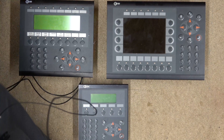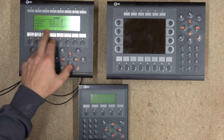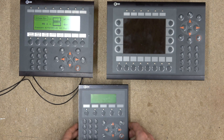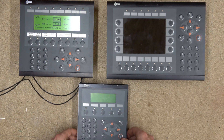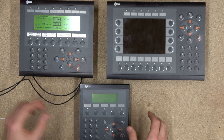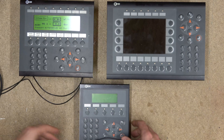Let's power up the panel. One thing we need to know is the firmware version and what protocol is being used, so make sure you note those down. When it starts up it shows you what firmware you're using and what protocol — basically which controller. Those are the two things you need to know. Then plug the RS-232 in the back, jump on the computer, and let's see how the upload and download works.